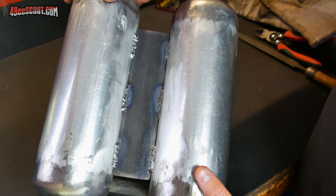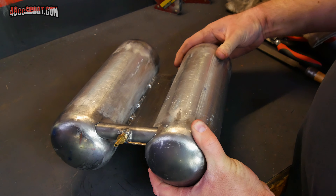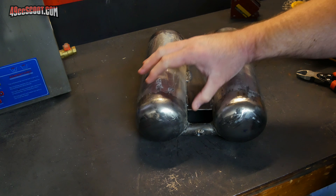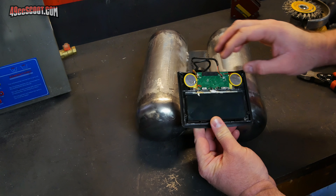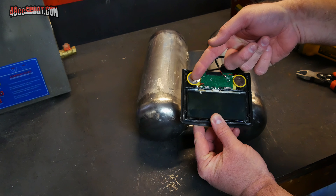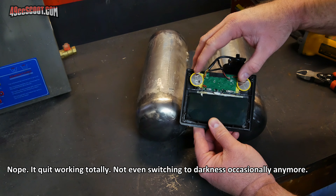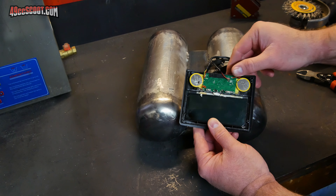I've got the bracket welded in — basically three spots on each side, done top and bottom — and I went ahead and left the crossover tube still loose. That's welded up now. Partway through, my welding mask decided to stop darkening, and I tried to just keep working through it — maybe not the best idea. I took it apart hoping to replace the batteries inside, but they really don't want to come off without ripping the wire. I'm going to order a new mask, and hopefully save this one for tack welds so I'm not at a total standstill.